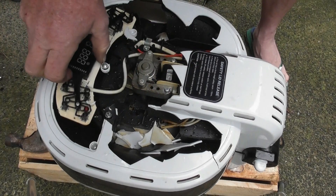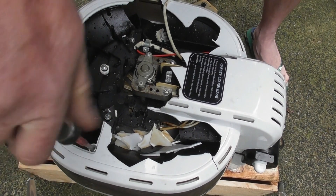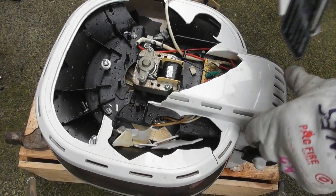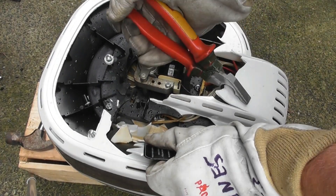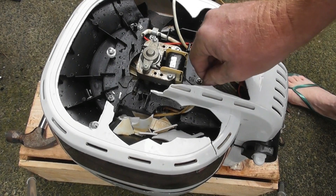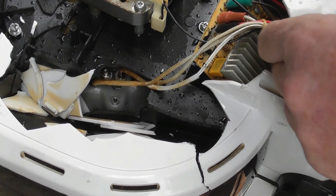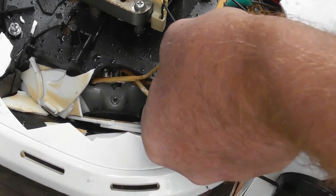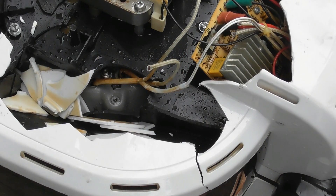Let's see how this device relies on cooling. I need to force it a bit harder — plastic, plastic, fantastic. I think we've got access to the heating wires, and these two bound wires here have a special heat-resistant material on them. I'm pretty sure it's these wires here, so we need to open them up. That's the thermostat — they've got two of some sort. I'll cut those off and clean them up and do a resistance test to see if the elements are still in one piece.